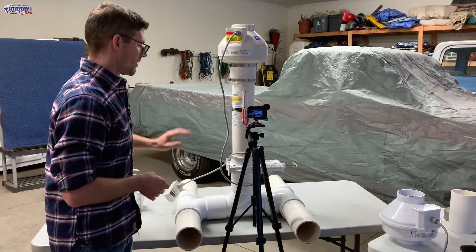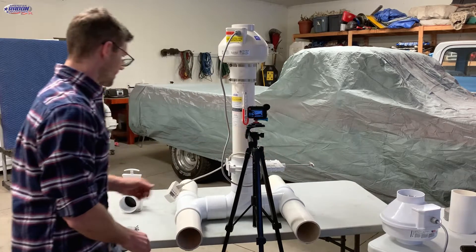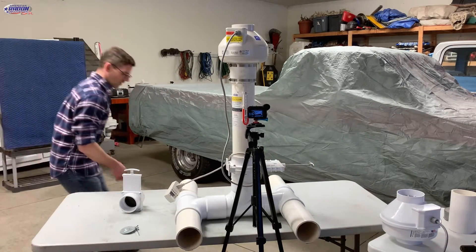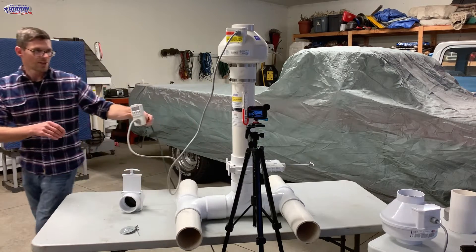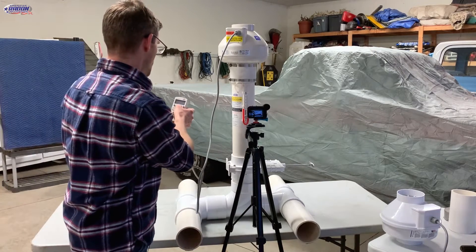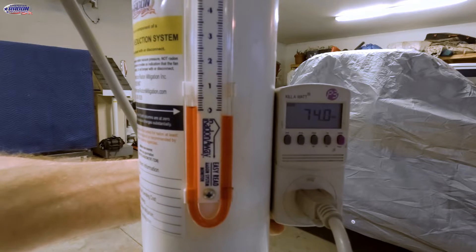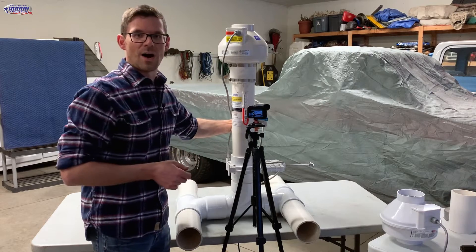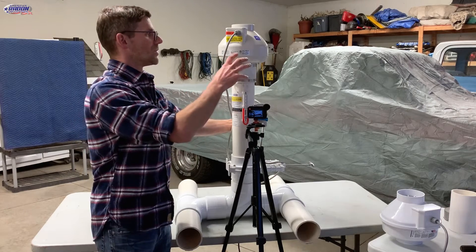So when I have this RP145 wide open — I'll plug this in — it'll consume about 65 watts. So I'm using my watt meter here, and at 11 cents a kilowatt it's about a dollar per watt per year to operate the fan. So if this is around 64 watts it's going to cost about 64 dollars per year just to power the fan.